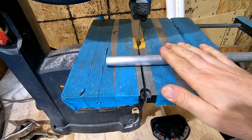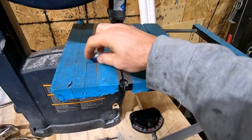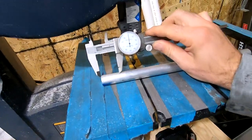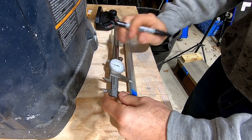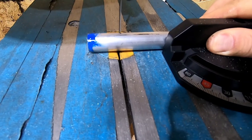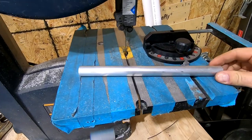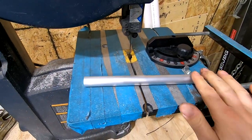First order of business will be to cut all of my pieces to length. I'm going to cut them about 50 thousandths long so I can face them to correct dimension. I'm going to mark them with a little scribe and cut them off here. Unfortunately, the center bore on the mini lathe is too small — otherwise you could just run it through the center bore and part them off exactly. I was able to get seven cut plus a little chunk, so let's start turning these down.